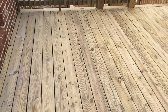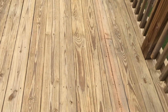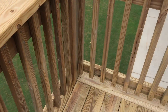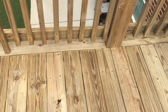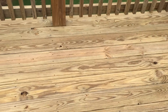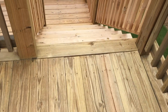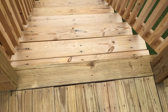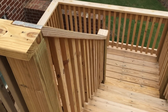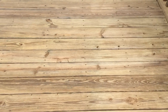Deck prep is now finished. I finished scrubbing the deck last night with step one of the Restore-a-Deck cleaner — I did the rails, the steps, the new wood, and the base of the deck. Then I did step two, which is the brightener. I sprayed it on last night but it started raining and got too dark to take a video of the brightening process. You can see the wood looks almost new, especially compared to what it was when I started the project. Here's the contrast of the old wood on the top step down to the new wood — not much of a difference. Once it's stained it should look pretty good. I'm pleased with the results; it was a lot of work. Waiting for two dry days so I can finish the process by staining the deck.